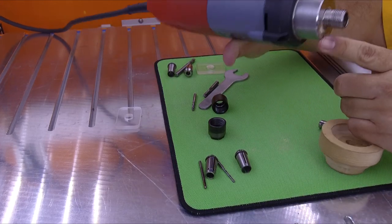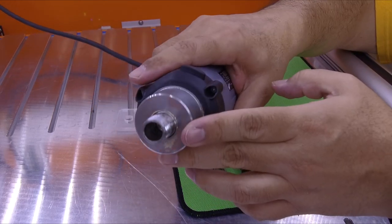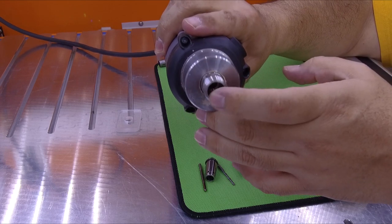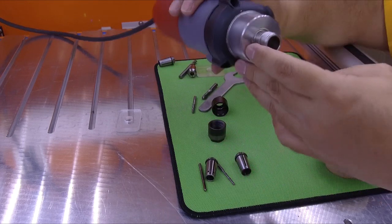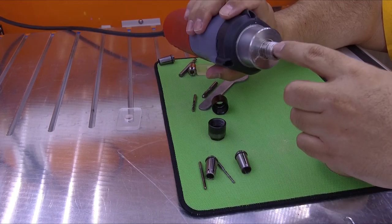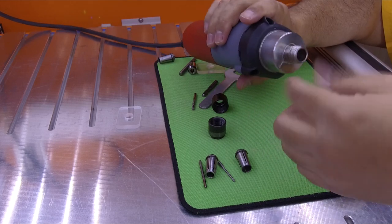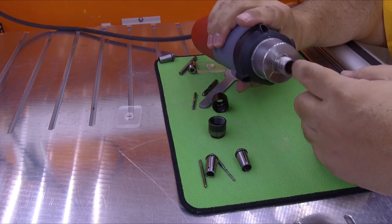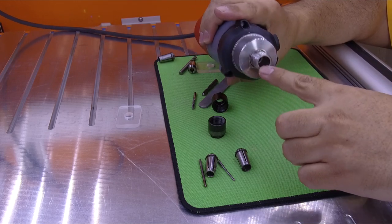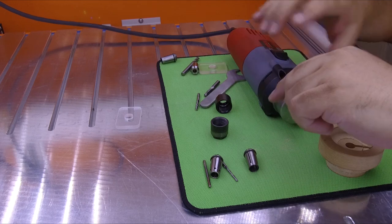After many uses inside the cone, if you don't clean it often, you can see that the cone inside can get stains. That's bad for the collets too. So it's good to clean this part as well. Use a cotton swab and isopropyl alcohol to clean the inside of the cone, and that will make the spindle last longer.